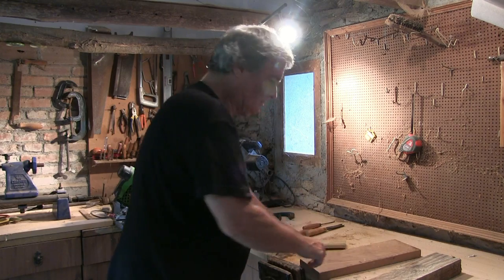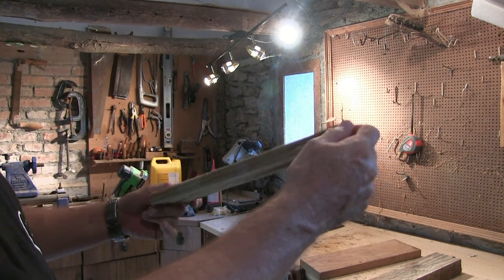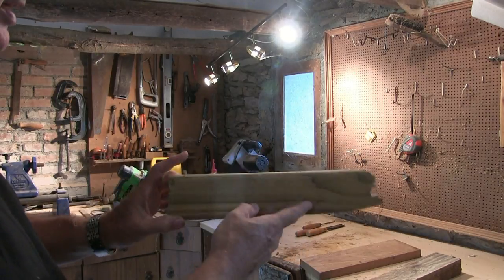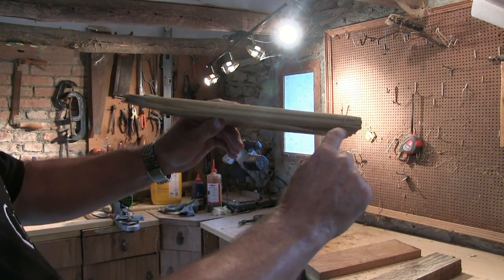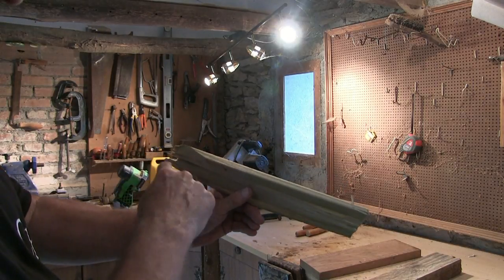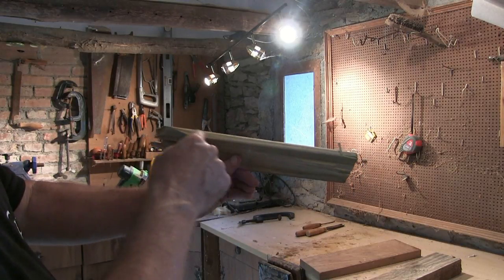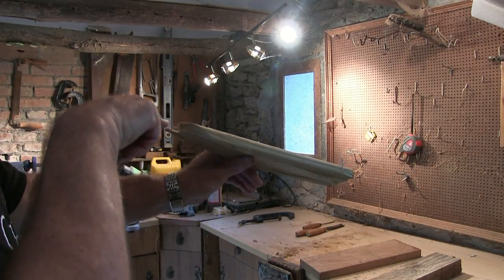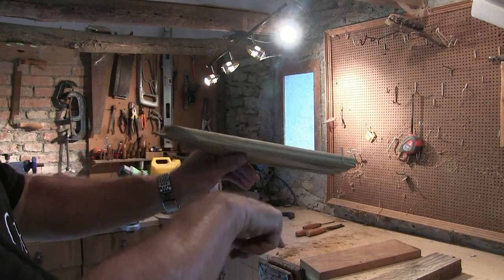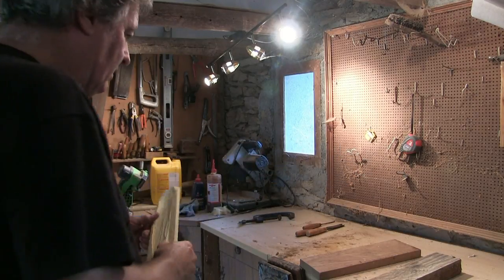You can see this piece of wood has actually split along the grain. There's the grain coming along here, and it comes up, then there's been a knot or twist and it twists up this way - the wood has broken away along the grain. So if I were cutting that way I would split that off, but if I cut this way it would go smoothly. You'll just work that one out.